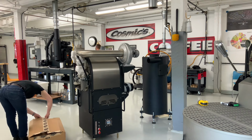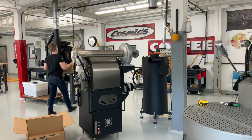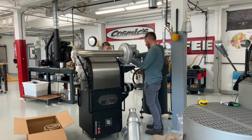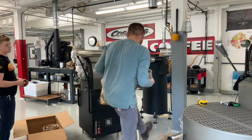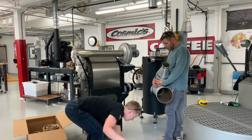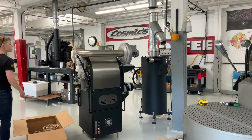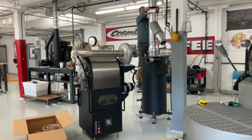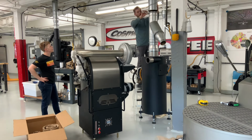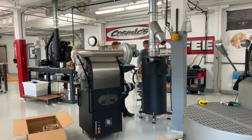Here you'll see me unpacking some of the MCR-6 venting kit. We're only going to use some of this venting because we have some of the venting left over from the older machine. So I set a couple things aside. Our venting specialist recommended that we do what's called dry fitting for the venting first, which means we got everything in place and we got everything clamped down before sealing the port adapters with silicone. You'll see us doing this at the end, the sealing part. This dry fitting process helps ensure that everything is positioned properly.